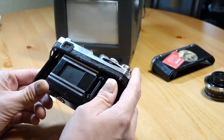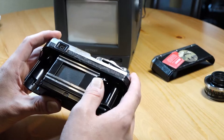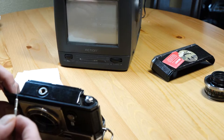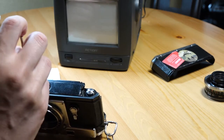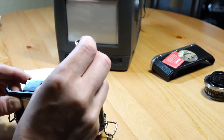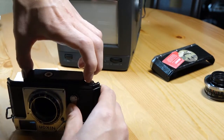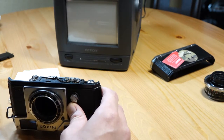It's pretty easy to fix that. You'll notice it very quickly in the photos, and I'll show you a way to see it with the CRT TV in a moment. The bottom plate's already a little loose — I loosened that up to save a bit of time. There are four screws; this is where you'd want to use your precision screwdriver with a two millimeter head. One tip: a lot of people try to keep the screws in the holes while moving parts. Instead, I'd suggest getting a little magnet and sticking all your screws to it so you don't lose them.